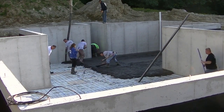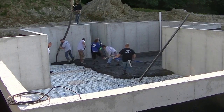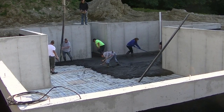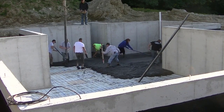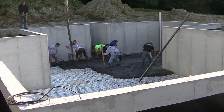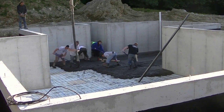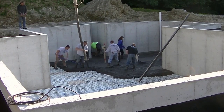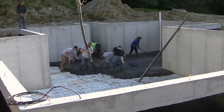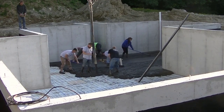As you can see, we don't pour the colored concrete much differently — really no differently — other than trying to keep the slump the same and not add any water to the concrete. For us, pouring it is pretty much the same as pouring a regular concrete floor, just a different color. It does get all over your tools though, so you've got to make sure you wash them really well after.